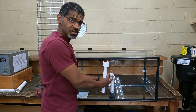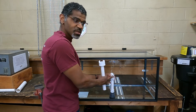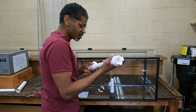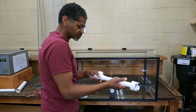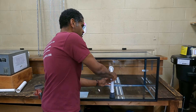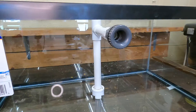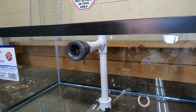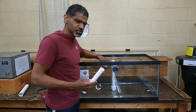You're going to have your T set up sideways. This is an overflow as well as a siphon break — so if the power goes out, you don't suck all the water out of your tank. Slide that in, then that goes on here. And you can see how that fits exactly to the bottom of the tank. And that is our overflow outlet.